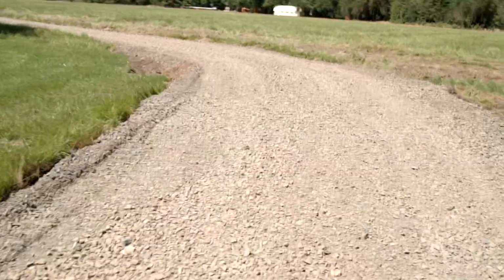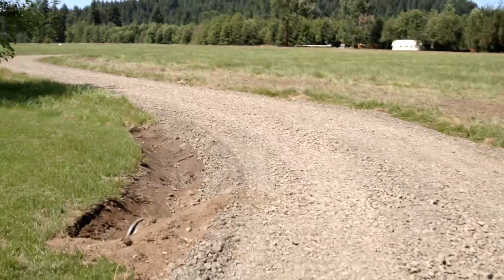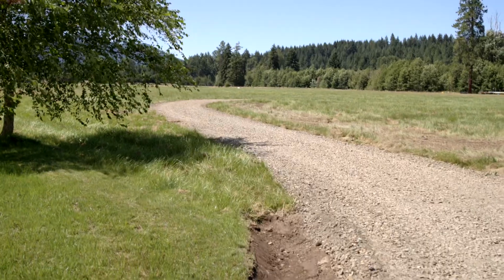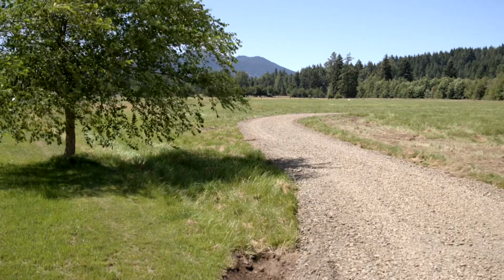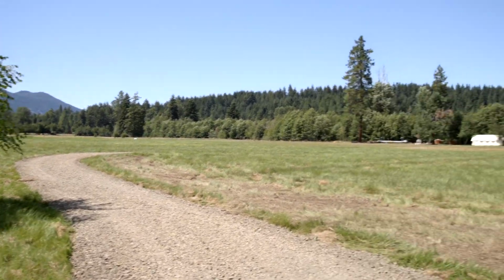We had to add one culvert, and that is for the flood irrigation, which we're going to have to fine tune around here. So we dropped a 12-inch culvert right here with a little collection pond, and because that rolls around here, and that's where it will cross the road over here, continue on its way to continue to irrigate. And then this just curves nice and gently enough that a logging truck can get through here without getting off the road and getting stuck, and down to the campsite and ties in with the river.